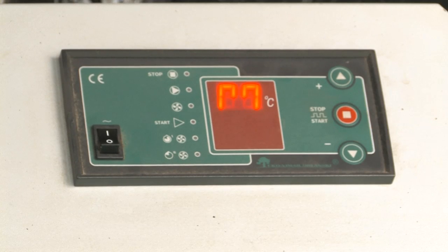With the fan modulation you need to use a factor of 10. Here the 6 represents 60%. The highest setting is 10, which is 100%. The variance is between 3 and 10, hence 30 to 100%, but it is advised to go no lower than 50% on fan modulation.